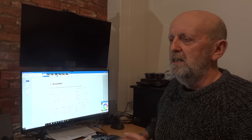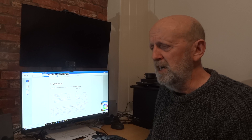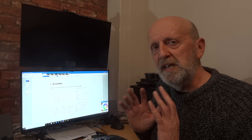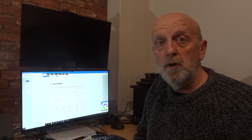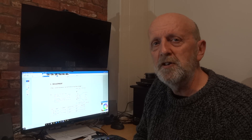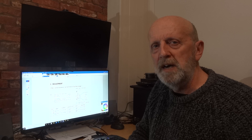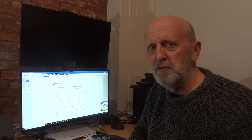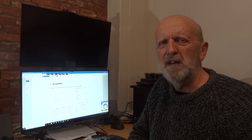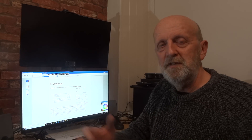The first thing I'll say is you've got to be careful. If you've never done this before and you're a bit nervous, then probably best not to do it. The amplifier is going to be live — you'll have a transformer with 240 volts going across one side, fuses with 240 volts on them, and your hands in and out. Also have someone nearby just in case, rather than doing it all by yourself. I've had quite a few electric shocks over the years, and I've also damaged things by dropping screwdrivers into units.